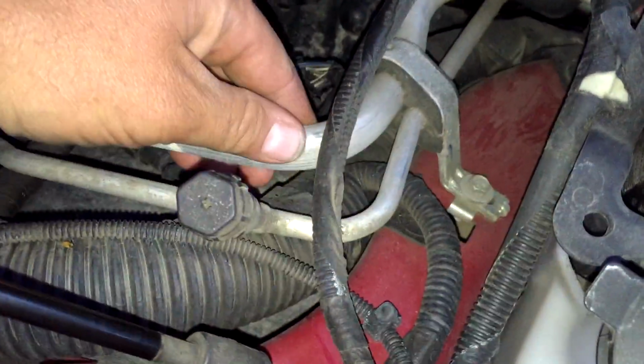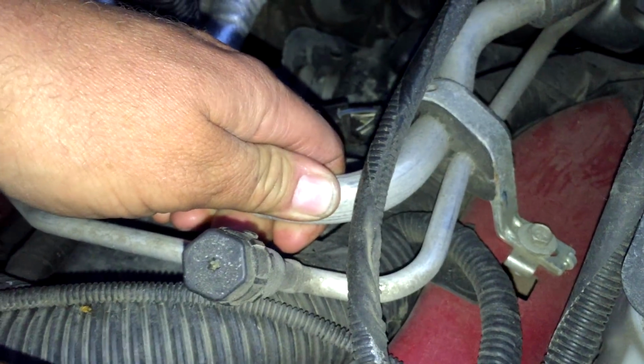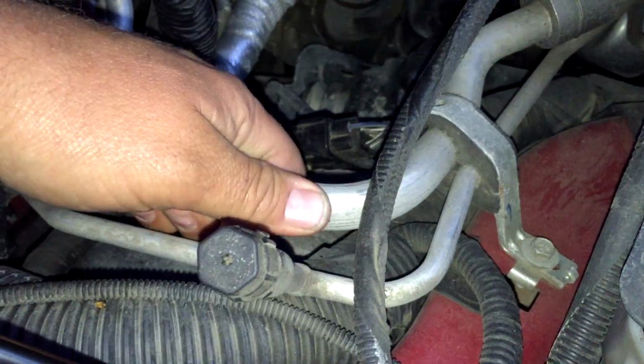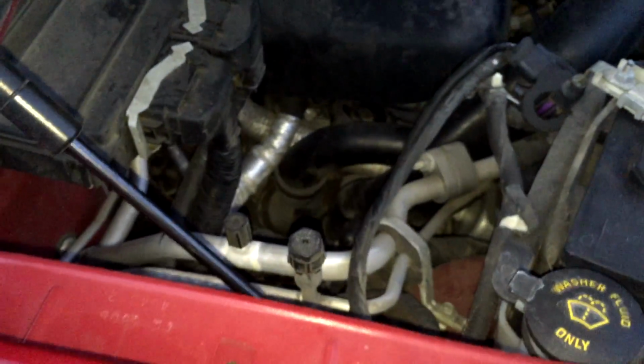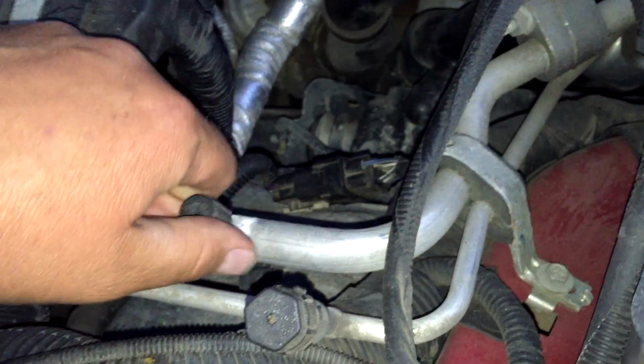I don't know. It's not too bad when it's nighttime and there's no sun and it's not really hot out, but when it's hot and crappy out, it wasn't running too well. It wasn't staying very cold. And the one line here that's going into the exchanger unit, it is fairly cold. Another telltale sign is when it was really humid out and I was running it, it wasn't collecting much moisture and it wasn't dripping much moisture off it.